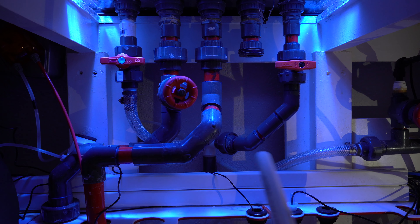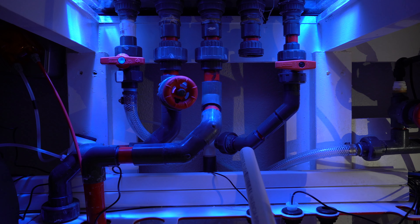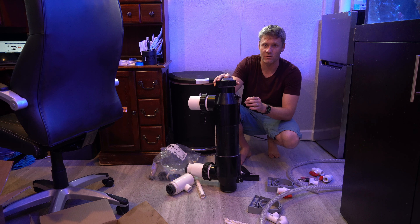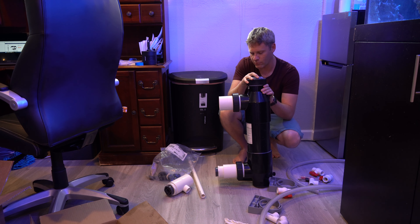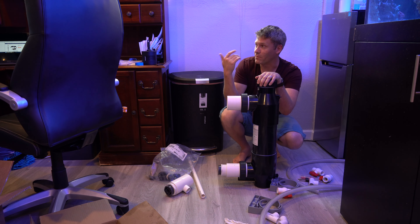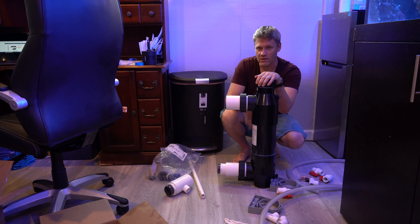It's not enough room in here to show myself connecting it, which is why I'll never have a sump underneath the tank again if possible. This goes out to the UV sterilizer, and then the pipe coming up has a T-split — you can see it behind there — that goes up to one return and up to another. No drastic 90-degree turns, so hopefully it'll flow pretty evenly.